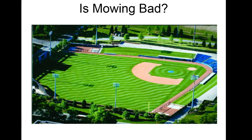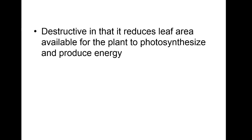When you keep changing direction, you get the cross-cut pattern. It's pretty cool. You also get ruts if you don't change direction. The Toro unit — I can't think of the name — allows the reel section to slide over so the wheels move out of the same pattern and you don't get rutting. There are a lot of different things that have come into the industry that have made it really fun.